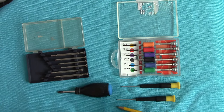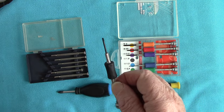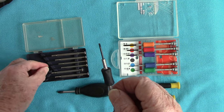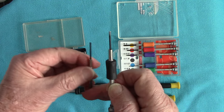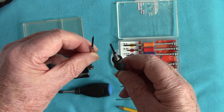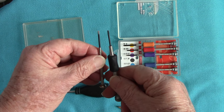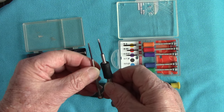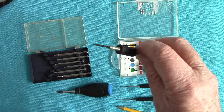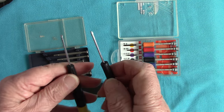The other thing is that the Japanese screws on the earlier cameras have a flat blade without a point — that's the flat bladed Japanese screwdriver. Now the thickness of the blade — you need a magnifying glass to see the difference — they look the same, but believe me, when you try to undo these Japanese screws it is much easier to use a Japanese screwdriver.